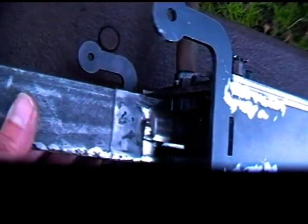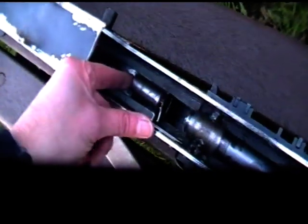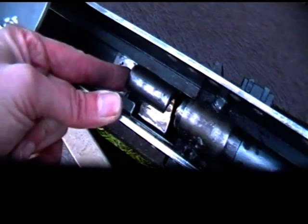So we'll just try the bolt in for size. Bolt slides in through the back here in these guide slots. Yep, runs in there okay. And that should slide forwards, and all being well, should slide just over the head of the blank. There we go. It's a little stiff at the moment, but that just needs a little bit of work, that's all. Now if you're looking through the side here, there's the 9mm blank just sitting there as it should do. So that shows that I've got the alignment correct.